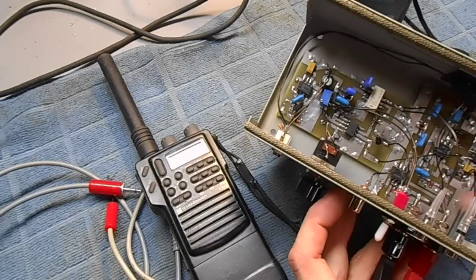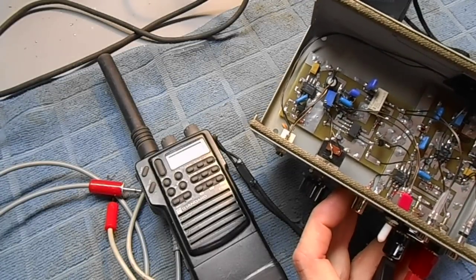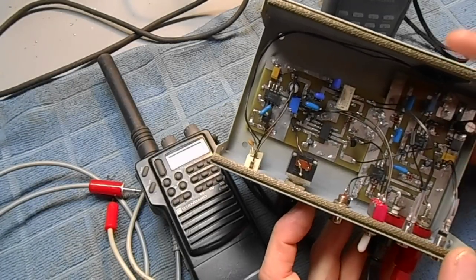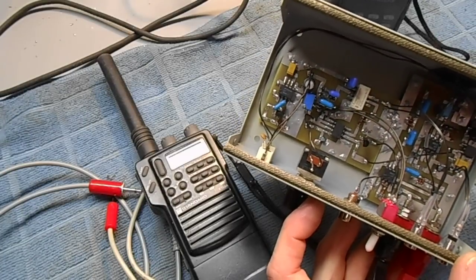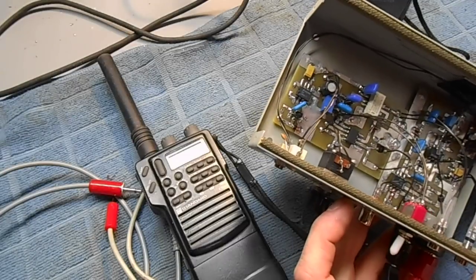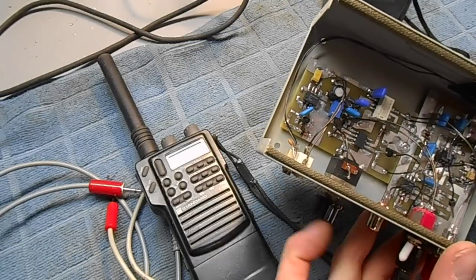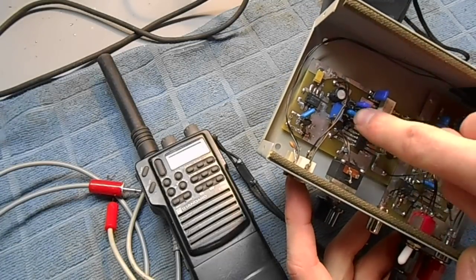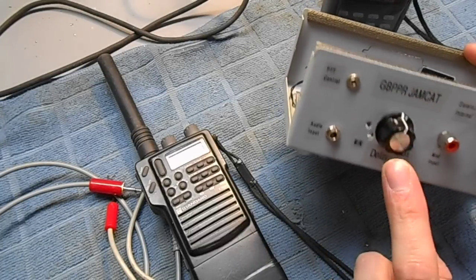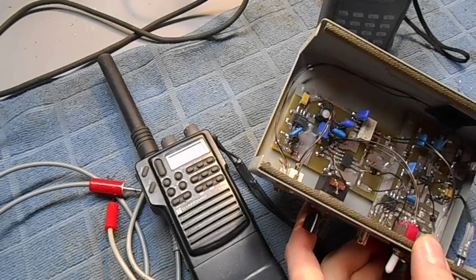By this point the audio signal is basically a square wave, and another op amp is configured as a precision half-wave rectifier to clip just the positive-going aspect of the square wave, giving you a positive-going pulse on detection of a valid audio signal. That positive-going pulse then triggers a 555 timer in a monostable configuration with a variable pulse delay, configurable from the front panel delay potentiometer.